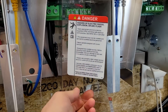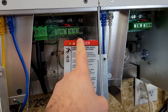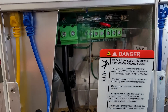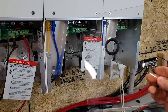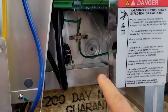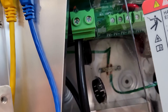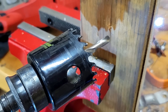I had to modify these plastic barriers between the high-voltage side and the low-voltage side. The PV side can go up to 600 volts, and the battery side maxes out at 58.4 volts for my setup. This is the last plastic barrier going in. Some of these I have two holes — one for the PV wire and another hole for the battery wire. I drilled it out by clamping it between two pieces of plywood, then using a hole saw.